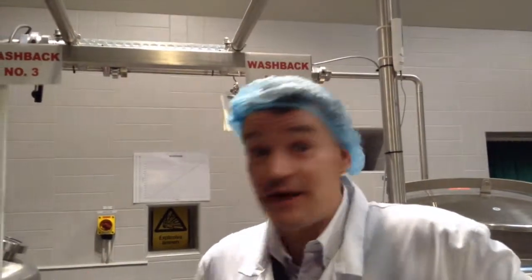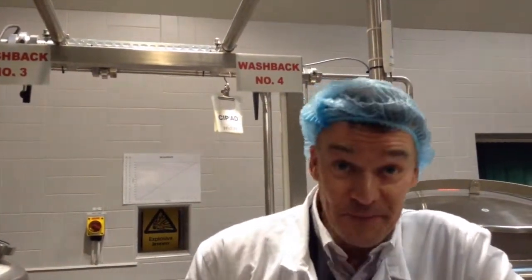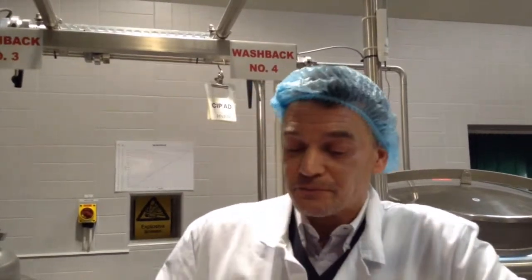And of course, we work with different yeasts, because again, looking into beers, and a bit Riesling, of course, but whiskey is nothing short of distilled beer. And in beer, we tend to say that the yeast is about 1/3 of the character. Looking into wines, it's about 10 to 15%. Looking into whiskey, it's somewhere between 5 to 10% of the character actually comes from the yeast. So if you just do a standard fermentation, you won't get any flavor. But that's why we have our own strain of wine yeast, we have our own strain of beer yeast, and then the distiller's yeast to get the alcohol.